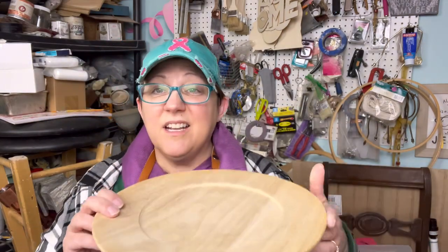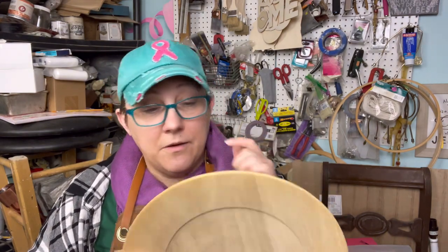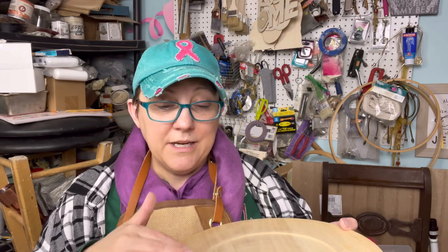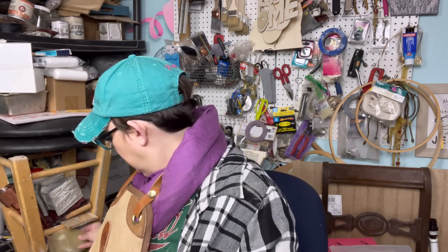We're gonna get this painted up and then we're going to drill a hole in the middle - this is gonna be our top, we're gonna put a cloche on it. I'm gonna give it a little sand by hand. It has a bit of a rough edge to it - this is just finished processing kind of stuff, so you do have like a little feathering texture. It feels very soft when you run your hand over it - that's the grain standing up. When you put the paint on it, it's gonna be rough and hard, so you want to tamp that down. I'm gonna get a high grit sandpaper.